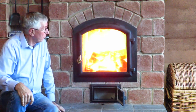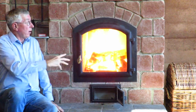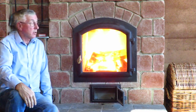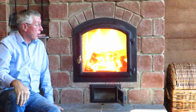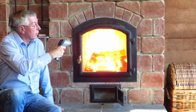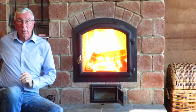So this fire's now been burning for over an hour, and as you can see, the pile has collapsed into a bed of extremely hot embers. I'm going to do something we don't normally do — open the fire door and see how hot it is inside. The fire door is incredibly hot and it's pushing out very strong radiant heat, to the point where Fiona, who is four metres away, can feel that gentle radiant heat from where she is. Yet the brickwork here never gets too hot to touch, and that heat will migrate through the whole masonry mass over the next hour or so. I'm going to use this electronic gauge to measure the temperature — at the moment the fire door is recording 442 degrees, but inside that firebox it's much hotter.